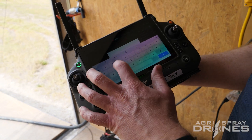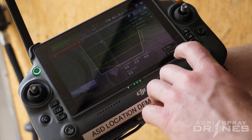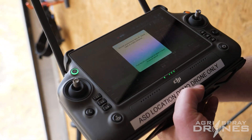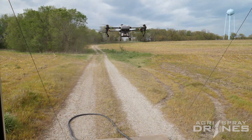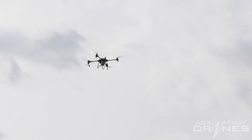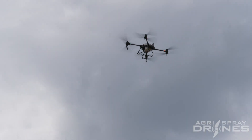Hit confirm, give it a name just like always — we'll give it a demo name. Then make sure the drone's clear to take off and hit start. It uploads just like a spraying mission. Slide right. The drone goes up to 90 feet, points the camera straight down, and starts taking pictures. It's important to note you should have the tank empty when you do this. You could actually take the tank out if you wanted to — it does increase flight time a little, so if you're mapping a large area, it might be good to remove it.